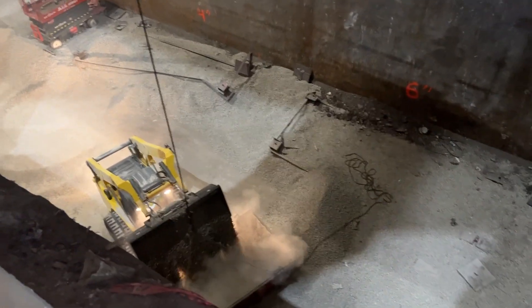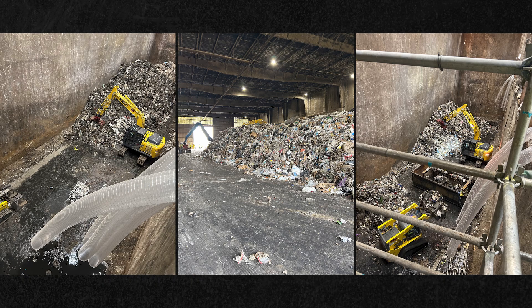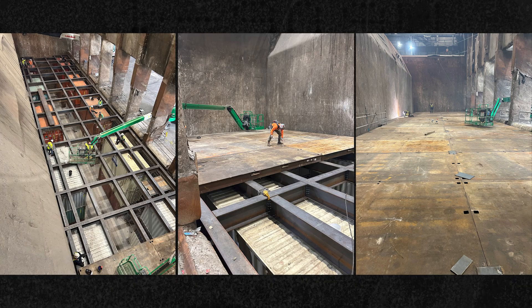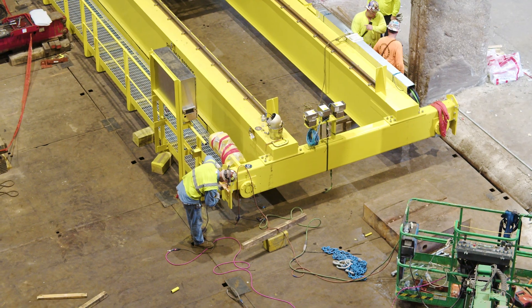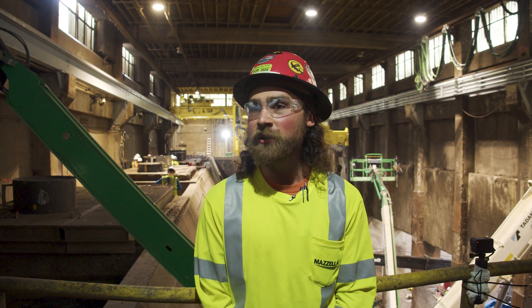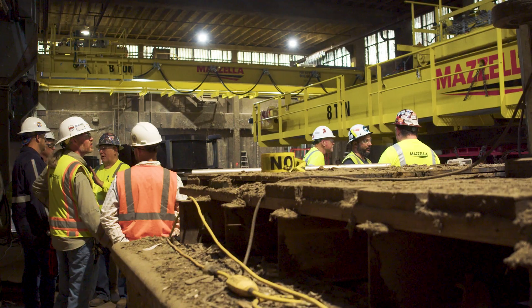Ultimately we ended up using stone to get the pit level. We came up with pulling all the trash out of the pit and stacking overseas connex boxes on top of each other — 30 in total. We built a steel structure over top of that, placed steel matting on top of that, creating what we call a dance floor. Nobody's ever done this before, so trying to figure out how to do it was pretty tough, but we all got together and found some good engineering companies and got it figured out.